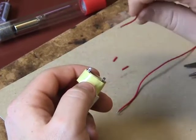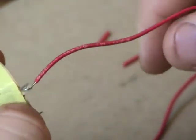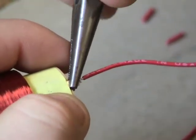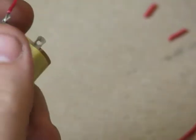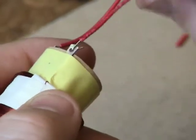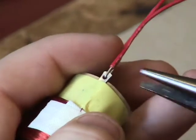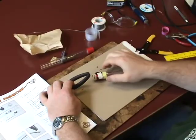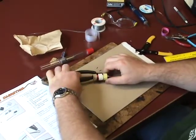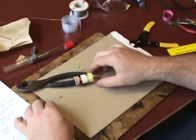Take your coil and place the hooked ends of the wires through the holes on the soldering lugs. Use your needle nose pliers to crimp the wire on the terminal to help hold it in place while soldering. Place one wire on each coil terminal. Now lay your coil down on the board and place the handle of your pliers through the coil to hold it still while soldering.